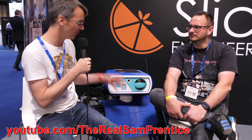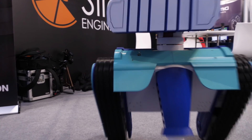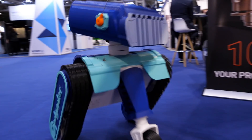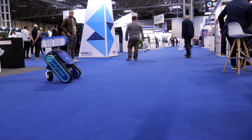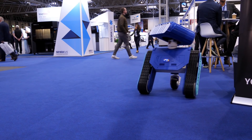So you've made this droid — I've seen a smaller version, what's the origin of this one? The origin of the droid was that it was concept art for The Rise of Skywalker. I've been working with Michael Baddeley on this particular design and also Polymaker, and we've used Slice Engineering hot ends to make this. It's all printed in Polymaker filaments — PLA and PETG for the frame parts, TPU on the tracks and the back wheel, and polycarbonate on the gearbox. We've got a 12-volt motor going into a planetary gearbox printed in PC, and it works really well. It's around 95% 3D printed.